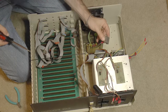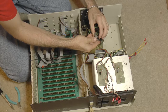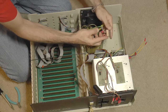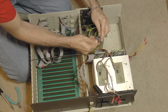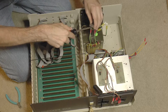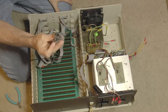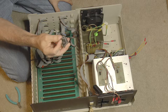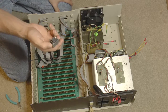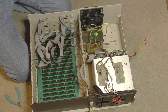This is the rectifier. It says GI — looks like General Instruments. The part number is KBPC 25-02, with a date code of 8038, so I would date this to the second half of 1980. It also appears to have a MOV — a metal oxide varistor — on the AC side, which makes sense for protection.